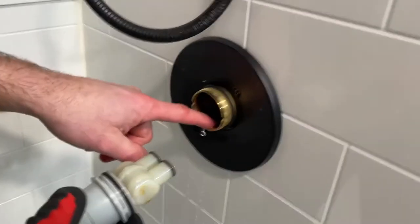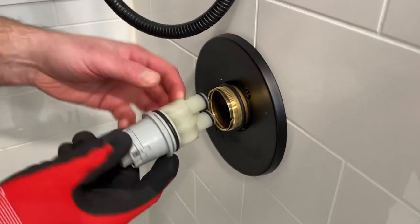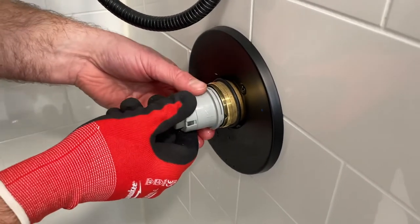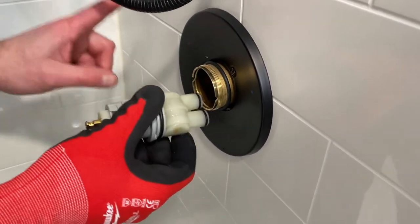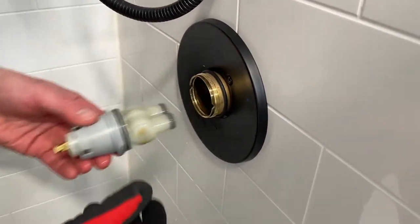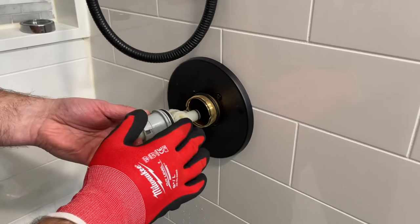If needed, grab a flat head and gently pop it open with a little twist. That's why we turned off our water, because it would all be spraying out of here. This is basically the cartridge valve, and the problem is usually — as you can see it says 'hot' here — hot was probably facing the wrong way toward where the cold is, and that's why your water flow was all messed up. All you need to do is reverse it, make sure hot is on your left side, pop it back in, and that's it. This is also the same process if you ever buy a new cartridge — just make sure you point it in the correct direction.